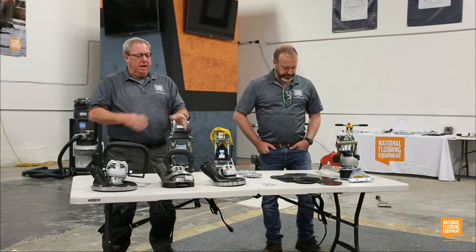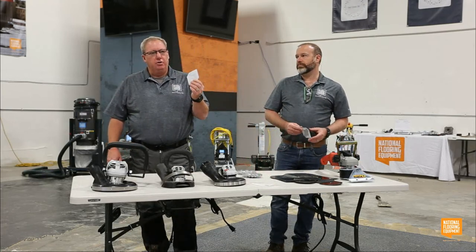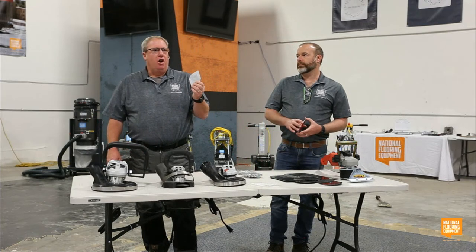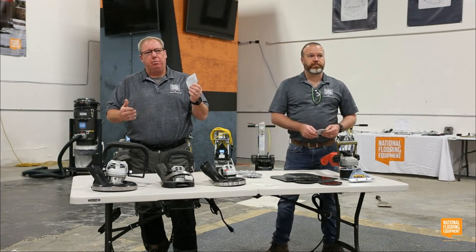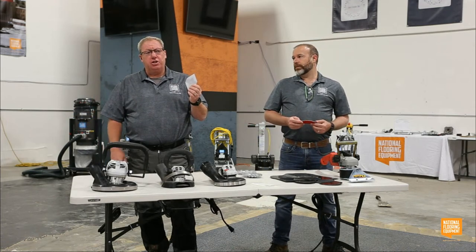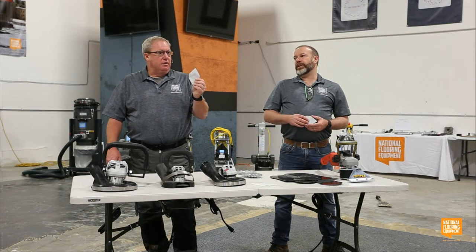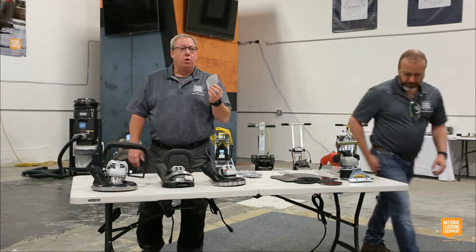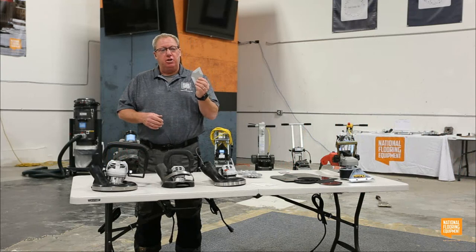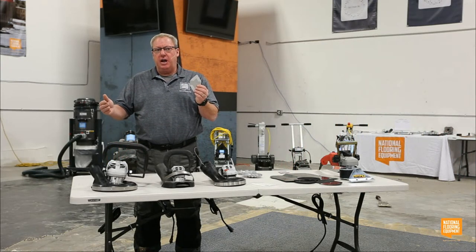With the triangle braze pads like this, 50s, 100s, all the way down to a super aggressive 16. So everything that you would need to prep or step up into the polishing process. And then you can also get these in all the way resin pads. Yep. So the resins look like this. I've got some somewhere. We could dig one up. Those start at 50. You can do a 50 polishing pad, a 100, a 200, a 400, an 800, a 1500, and a 3000.